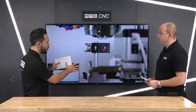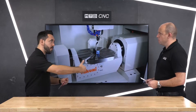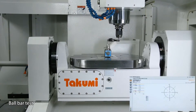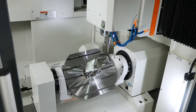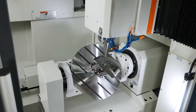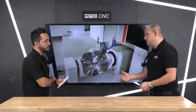With the double column configuration on a fifth axis machine, you also get a greater Y-axis travel. When using a trunnion style, most work is done with the trunnion at 90 degrees, so that really comes in handy. You also get greater access to the machine, and the ergonomics all make the design perfect for five-face machining — which is the UC range.